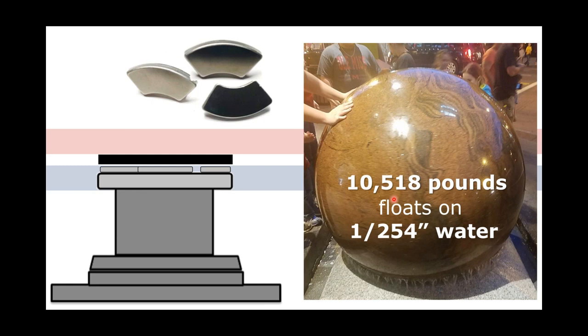When the motor is running, the carbon bearing is not in contact with those segments or shoes at all. The only time it actually contacts them is when the motor is in standby or idle. We've done modifications to the segments and shoes to get a nice thin film of water to glide through very efficiently. On a 24-month audit, bringing these pump motors back, we found no wear at all on that bottom bearing. I just wanted to walk you through a few of the components that make up these motors.